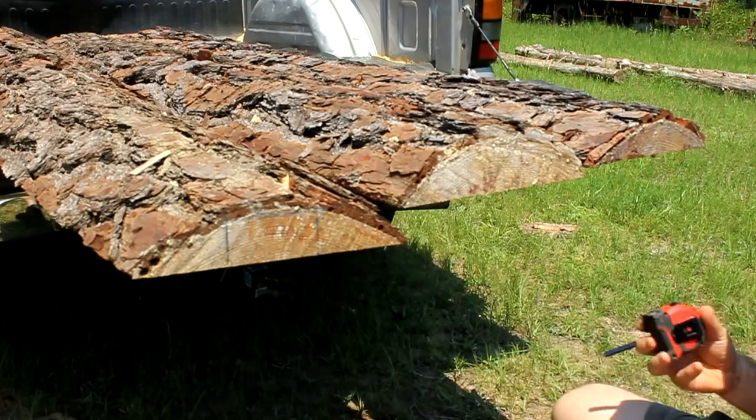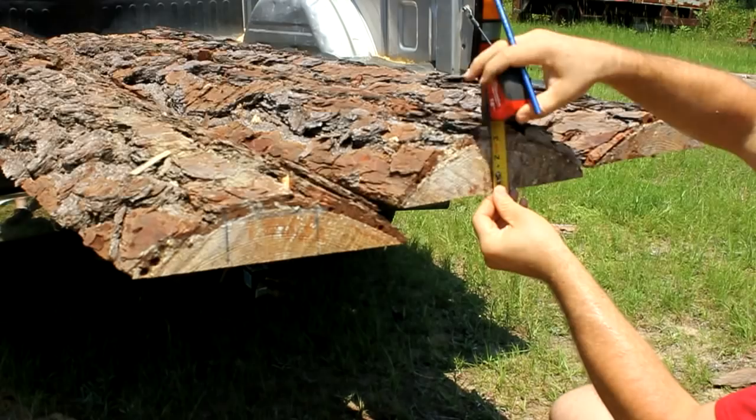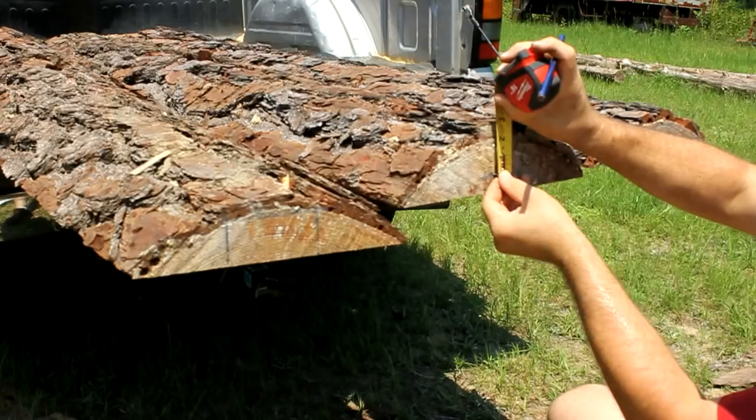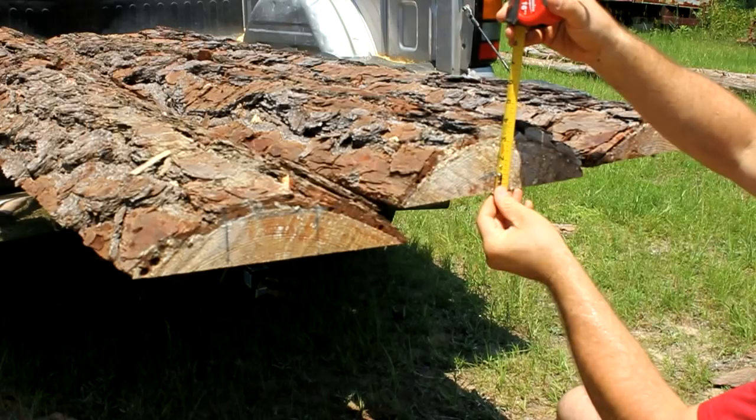So this one is going to be about 2¾ inches wide. But let's go ahead and mark off the 1-inch mark down here. That's going to be our 1-inch mark. We'll see how much we can measure up from there. That's a little less than 2 inches. We may could get like a store-bought 2x4, maybe a 1.5 by 3.5 out of that. I'm not sure, but I'd like to try to get a 1x out of that. So let's go ahead and mark off our 1-inch all the way across here.